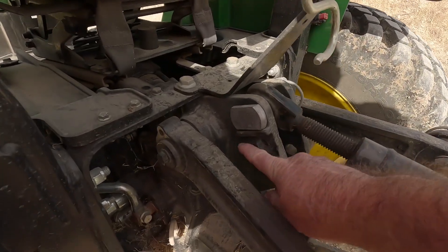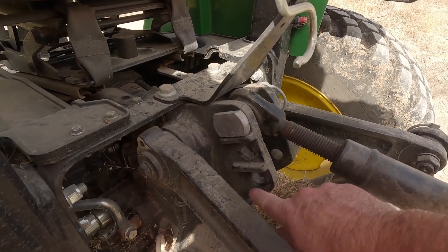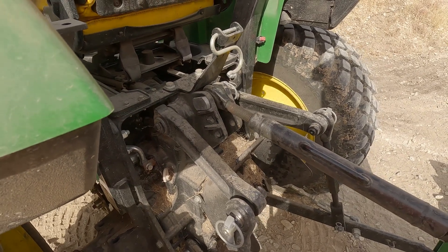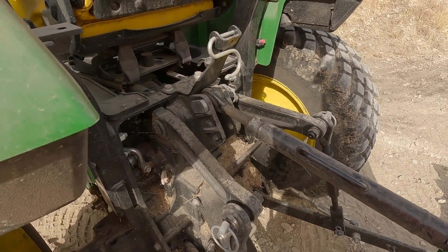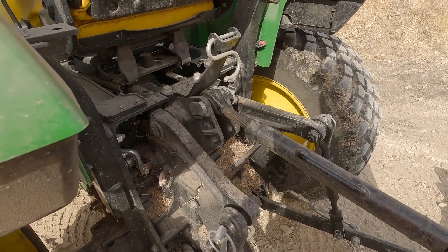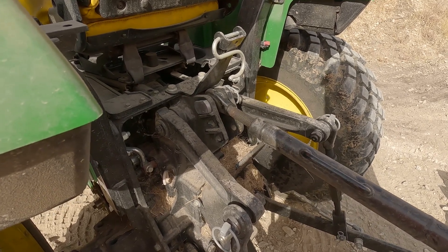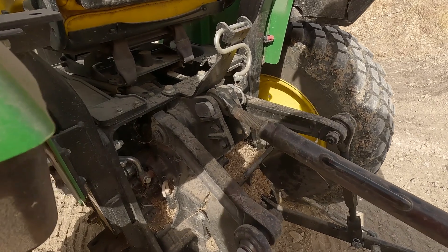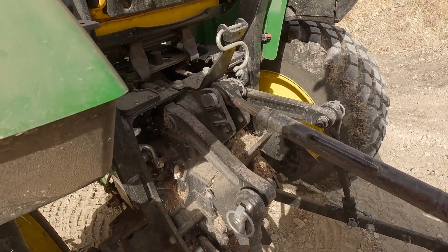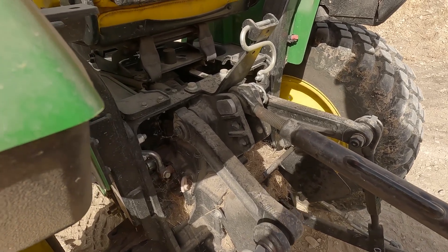It's got a little bit more meat there — you're not going to break it down here. The weakest point on the very bottom one is right here, and I have seen quite a few of those pop off. When they break, most of these are cast housings, and what you'll see is it'll totally crack out the whole housing and you'll end up having to buy a new one. In some cases you may be able to use the second or top hole and not worry about the bottom one. But the whole idea is not to damage your tractor.